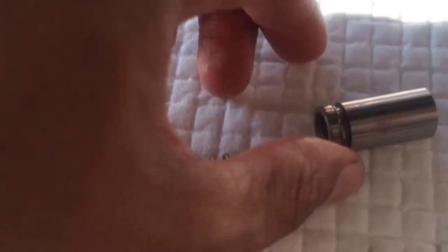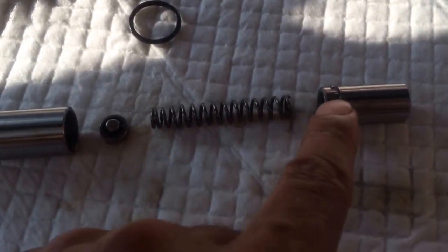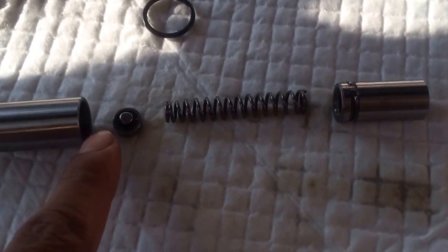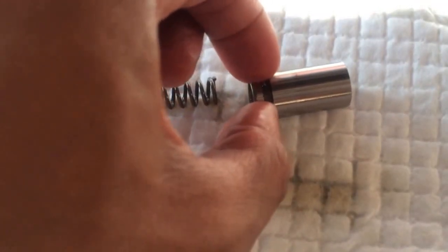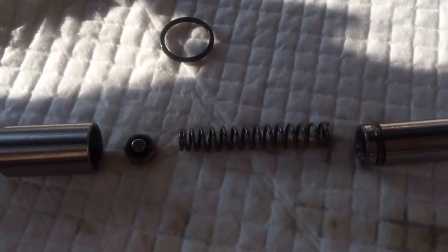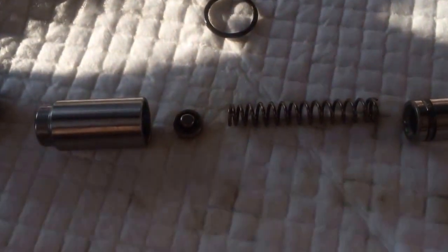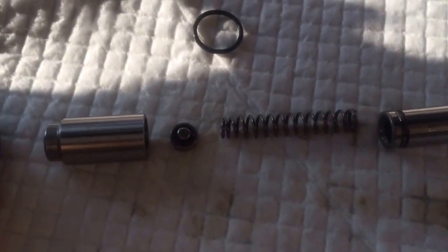The last piece — the other half of the body — has a lock washer that needs to remain in place. During the first reinstall, this washer had a bit more tension and it was very difficult to put all the pieces back when it was time for the washer to go inside the body. What I did was take a needle-nose plier and crimp it so it was a bit tighter and closer together, and that made it a lot easier to put it back. It goes in reverse order, back only one way into the motor. Tighten up your nut just snug, and you're all done.